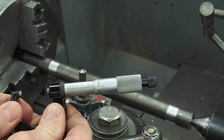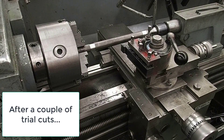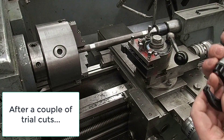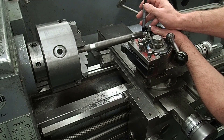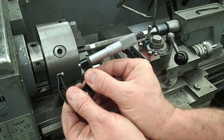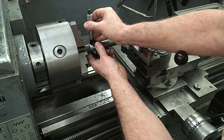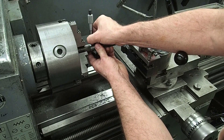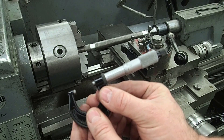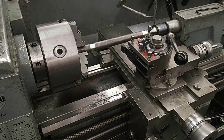So we may have to do a little bit more adjustment, but you get an idea of how this is done. Checking with the micrometer, the far end is about 934 thou, and the other end is very close to the same size. This process may have to be repeated a couple of times until you get the tailstock in alignment, but hopefully it will help save some of the grief you're getting from turning tapers.